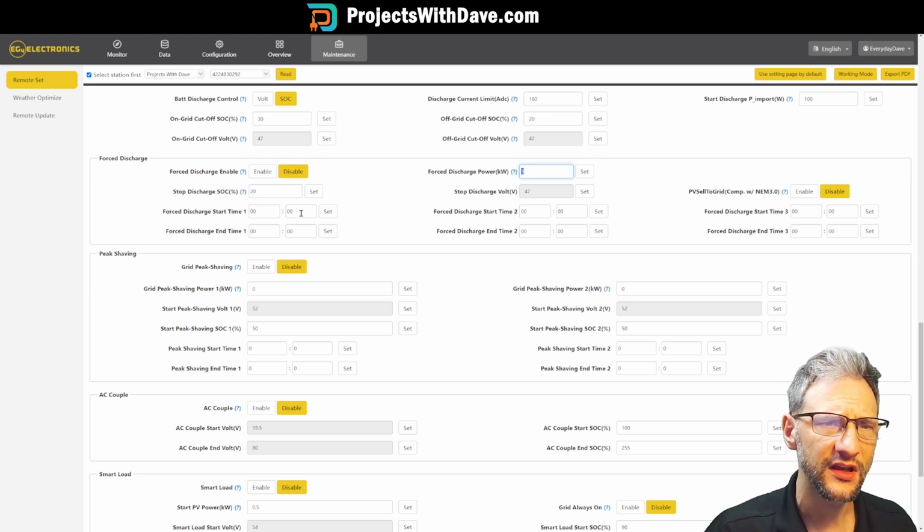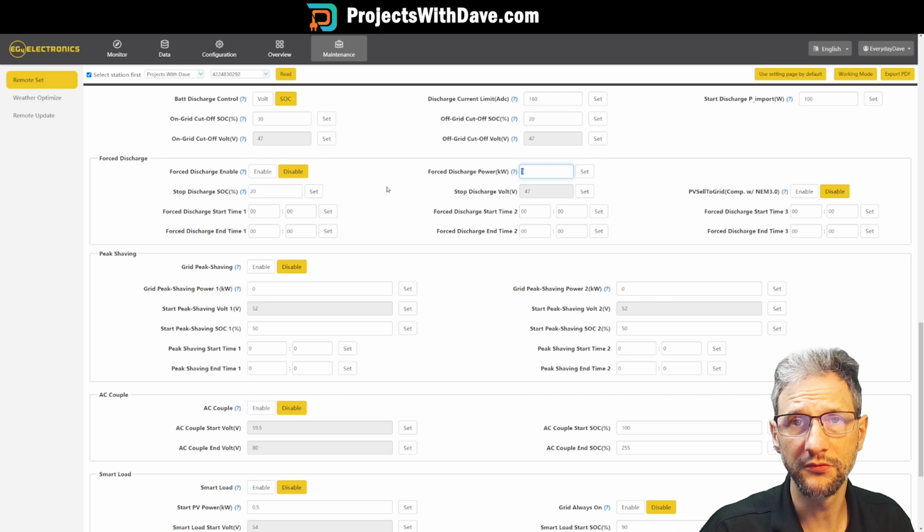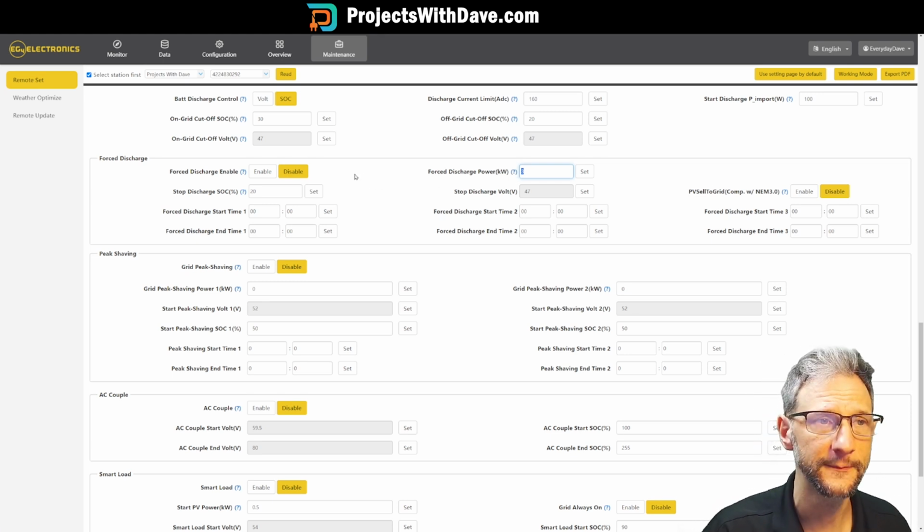And I've messed with this a little bit. I've had settings where I would discharge during the day, and I would have it set to 3,000 watts. If there was only 2,000 watts of PV, then I would be putting 5,000 watts out to the grid. And if there was no PV, I'd be putting out 3,000 watts to the grid. But for the most part, I just have that disabled.